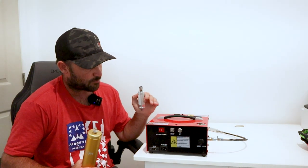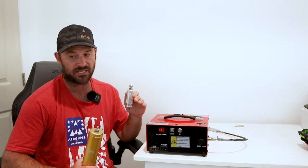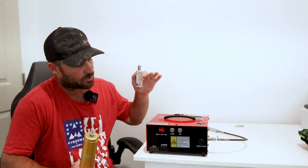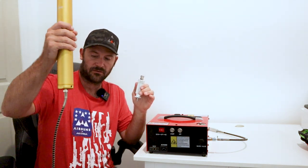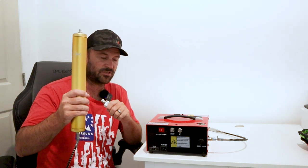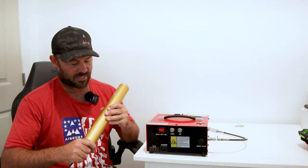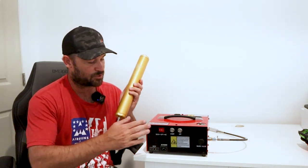Now we've come full circle back to the compressor, but now we're talking about filtering air for compressors going to your air guns. The same logic applies: hot air will carry moisture to your air gun. So you need to keep the unit cool and run it as little as possible. The same logic about larger filters also applies — a larger compressor like a Daystate or Omega can actually utilize a large filter like the Tuxing and give you drier, cleaner air because it has the volumetric ability to fill it with ease. With a small compressor, you might have to turn it on and off three or four times to pressurize the filter.